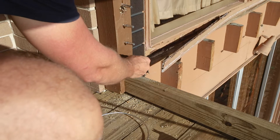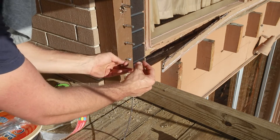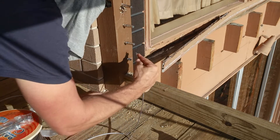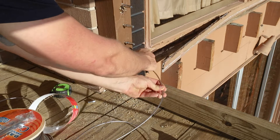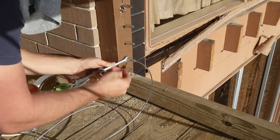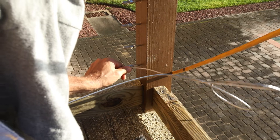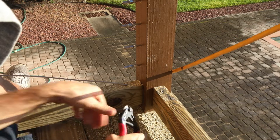To install the cables, I carefully remove the stud compression cones. Inside the cone is a wedge fitting — I slide the cone onto the cable first, followed by the compression wedge. Then I install the cable into the lag post, making sure to thread the cable through the washer that often sticks on the lag post when the cone is removed. With the cable inserted, I slide the wedge and cone up to the threads on the lag post and hand-thread the cone into place. Then I use two wrenches to tighten the compression cone down snugly, which binds the cable into a locked position. I stretch the cable to the corner post, line it up with the length of the cone cap fitting, and use a cable cutter to cut it to length.